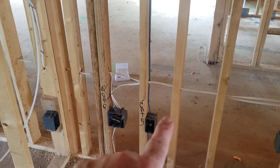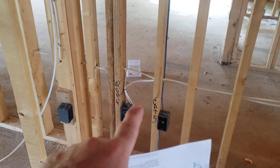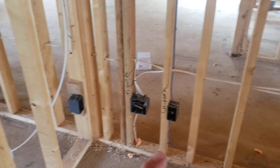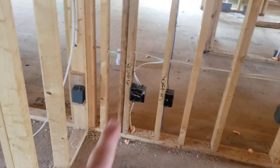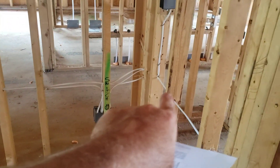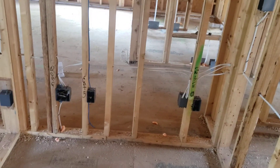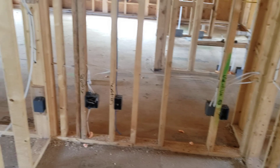These are data as well as regular plugin outlets for your peripherals. But if they're going to be inside the cabinet, that's no problem. This first one here is 14 inches to the left wall, 24 inches to the corner. The one on the right is 12 inches to the right. So pretty much two 30-inch bases will fit both of those no problem.